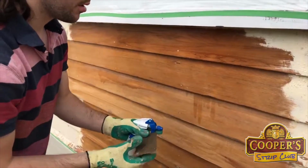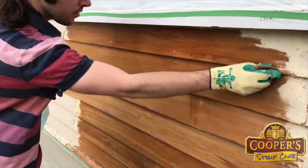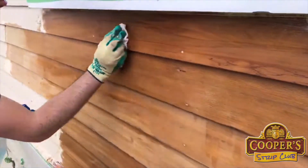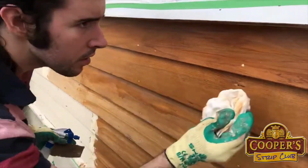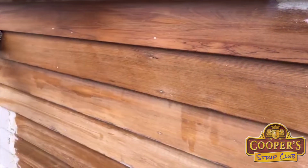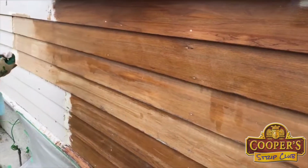So this flusher is a paraffin-based spirit, and it's not neutralizing anything. This is not a neutralizer. It is a rinse, and we're rinsing away residues of paint. We're rinsing away residues of stripper, and we're going to leave the wood clean, dry, and absorbent. It'll be a bit of a shame to paint over it, but there you are.